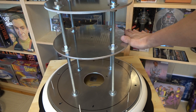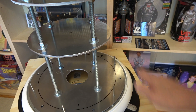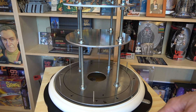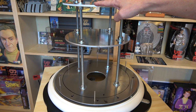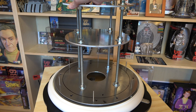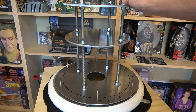I wanted to make sure the two rods were basically on the front facing forward. That way, when I come back to do the arm supports, I can put little aluminum wings bolted to this that stick out, and then mount the arms on those. So before you start drilling holes, make sure you have everything aligned the way you want — both the screw holes with the torso and which way your threaded rods are facing. It all depends on what you're trying to do on the inside of your robot.